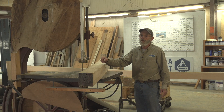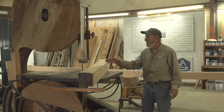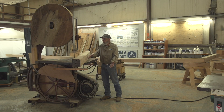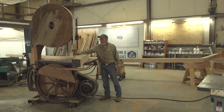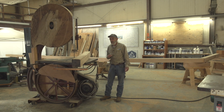I have a re-saw bandsaw, but it only cuts straight — there's no way of going around corners with it. This one will. You can cut floor timbers with it, deck timbers. This is one example right here — we're just cutting a six-by, it's a deep cut and it's curved. I have another bandsaw that will re-saw but you can't cut a curve with it. So this is the thing. It's got enough set so it cuts wider really than the blade does. This is going to be a nice little cut right here. It's got seven and a half horsepower — it doesn't slow down at all. It'll cut through anything you put up there, so we'll show you how that's done.